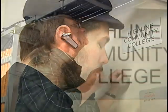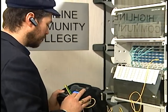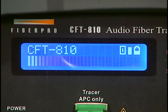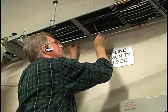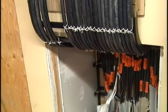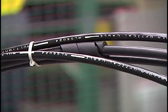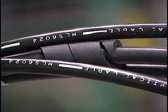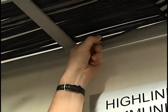The technician operating the instrument can now communicate with the remote technician over cell phones. The remote technician now begins gently tapping the suspect cables in turn, while the instrument operator listens for the loudest and clearest sound in the headset, as well as movement of the displayed bar graph. It's important to use the same amount of force when tapping each cable — a small force using a light tool like a pen or the handle of a small screwdriver works best. To prevent vibrations from passing between cables and giving false results, it's recommended that they be separated for a few meters along their length. If the cables are tied together, untie them and apply acoustic vibration pads where the test cable contacts other cables to reduce crosstalk. These pads are supplied with the instrument. Repeat this procedure on several cables until the target cable is positively identified.